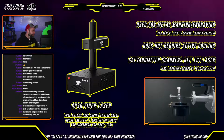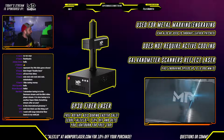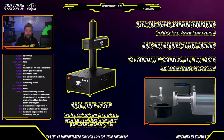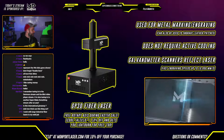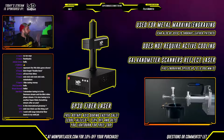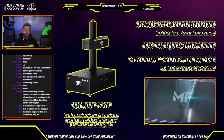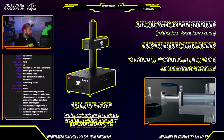But again, the long and the short of it is that fiber lasers, like this GP30 fiber laser that we have here, are essentially made for engraving various types of material. And the way they work is that, unlike a CO2 laser, which has a big laser tube in the back, these lasers don't require any active cooling. It's a fiber laser source that is passively cooled and air cooled.